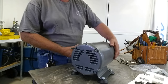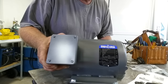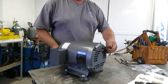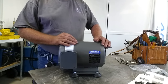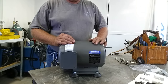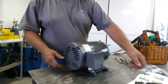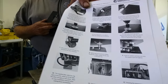The first thing that strikes you is what's missing — no shaft. They used the rear end bell twice. The only thing special about the motor is the rotor inside: it's an 1800 RPM motor, so it's a four-pole. They've done their testing on whether the higher RPM two-pole or the four-pole makes the best generated third phase.